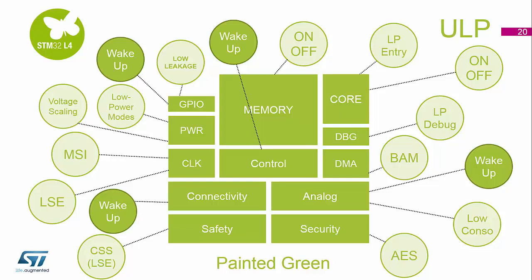The DMA can do batch access mode, so we can do various things in large chunks and keep the device in sleep mode a lot longer. We can even run the debug cell in low power modes, so that when you're doing your development, you don't break the debug chain back to the PC so that you can manage what's going on in the system.